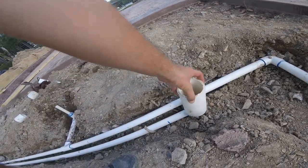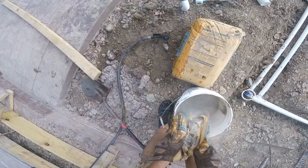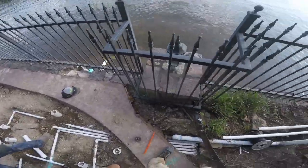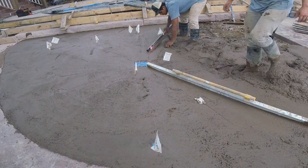After all our sleeves are cut, we use Quikrete to set them in place so they don't move during our pour. The last thing we do is run our lighting wire up into the splash pad and set our lights splitting the difference between all the nozzles on zone one. This gives an inner and outer circle effect.